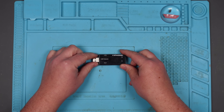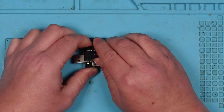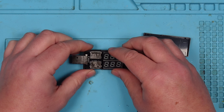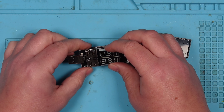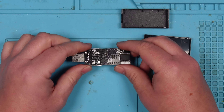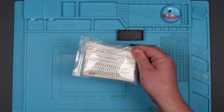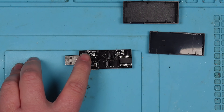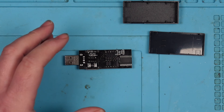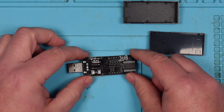I had a few comments about this after I fixed it up in this video here. Quite a few people pointed out, and probably quite rightly, that the smaller resistor I put in here is probably going to struggle, especially if the last one burnt out. So I have ordered up some 1206 size resistors, but what I wanted to do first is just test it — I wanted to see if this gets hot, and if so, how hot, and then compare it to the correct sized one.